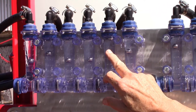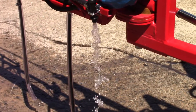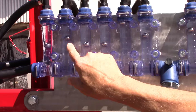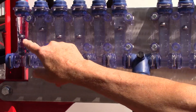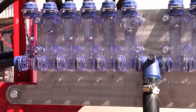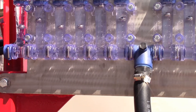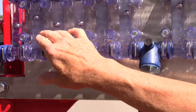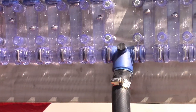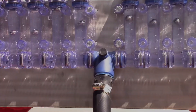One is represented like a hose is busted — too much flow. Another one has a reduced flow. The third one has no flow. So you're seeing exactly what the visiflow is supposed to do, but each one of these visiflows represents two nozzles. So we'd have to go to those two nozzles and find out which one is not working correctly.